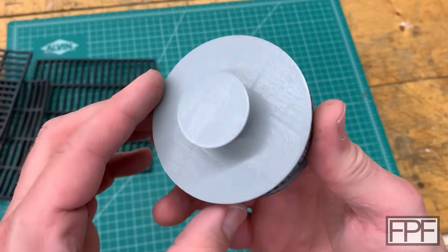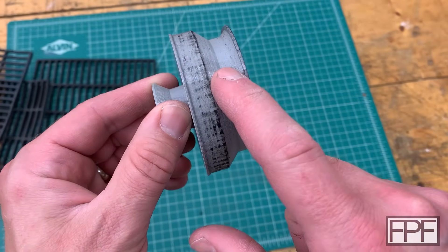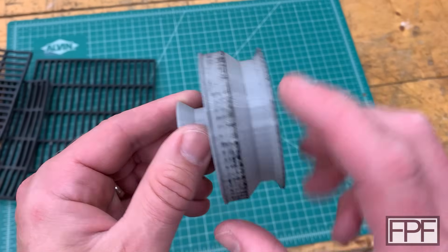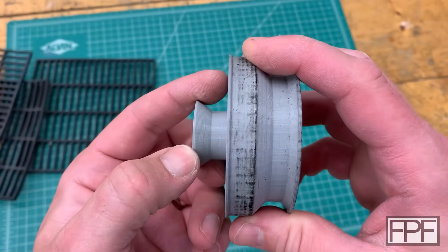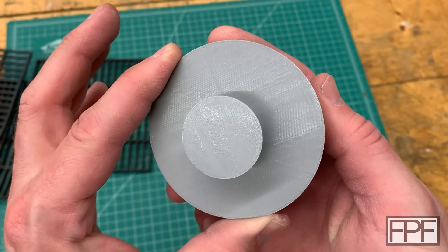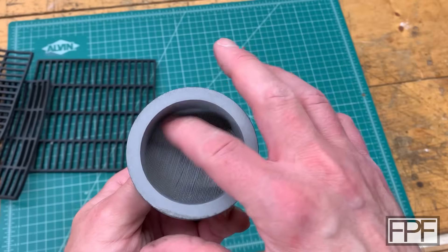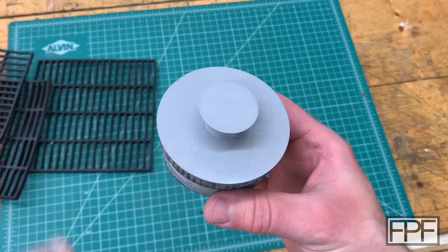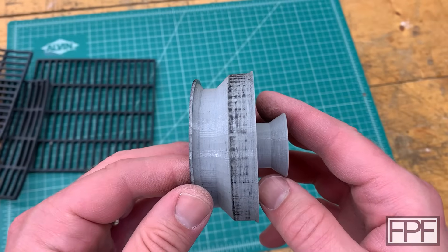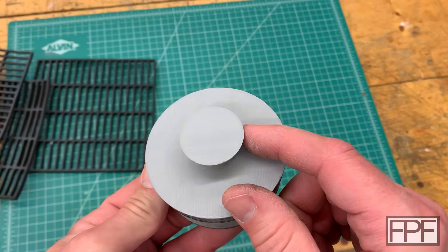Back in the shop with much better lighting - you can see the surface of this piece compared to the inside surfaces that haven't really been in the weather. They look pretty much the same - these are still shiny. It's not brittle. I poked this with my fingernail. This is plain old Hatchbox gray PLA. It's not faded, it's not deteriorated. Actually it's closer to seven and a half years that this thing has been outside in full sun exposed to all the elements - it gets wet, goes through all the seasons, I've seen ice on this thing in winter. And it looks amazingly good.